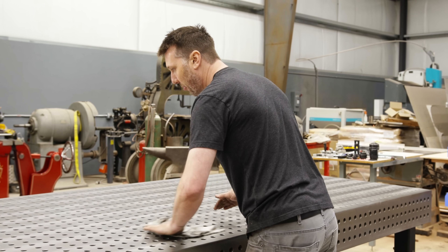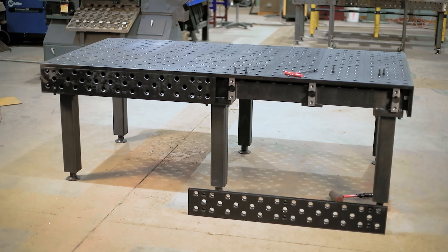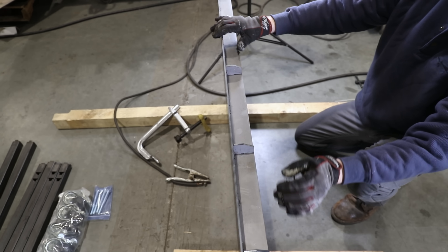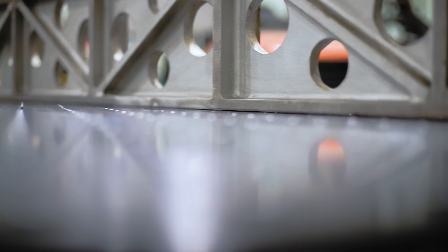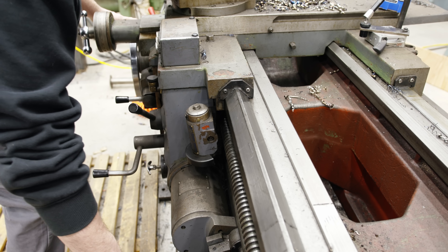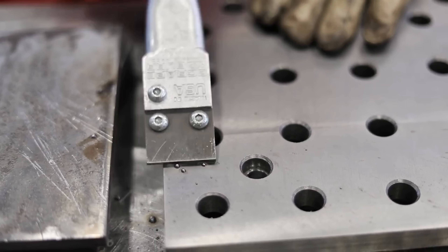The first item on that checklist is the material. I decided to make this table out of gray cast iron. All the other tables are made out of steel, and when you make stuff out of steel they're basically like a big rubber band — they have a lot of flex and twist, they're kind of spongy no matter how you build them. They have a level of accuracy that's really hard to maintain, especially when you're trying to hit that aerospace accuracy of two thousandths of an inch in two feet. Gray cast iron is the best bet for that — if you look at any lathe or milling machine, they're all made from cast iron because they're extremely rigid. The second benefit of gray cast iron is that it repels weld spatter really easily.